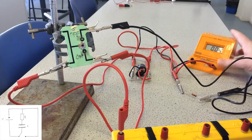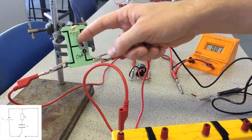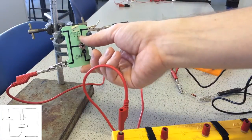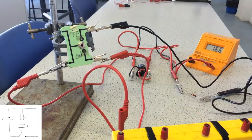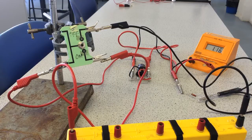So we should see something different this time. When I turn it on, the capacitor will charge through the resistor so the charging process will take longer. And it will also discharge through the resistor, so we'll see the voltage go up slowly and go down slowly. There we go — that's the voltage increasing very slowly in comparison. The time constant for the charging process is longer. And if I flick it up before it's fully charged, then it's discharging through the resistor also. So that circuit uses the two-way switch so that both charging and discharging occur through the resistor.